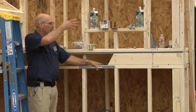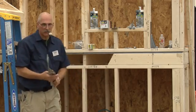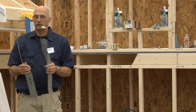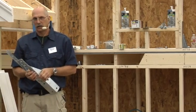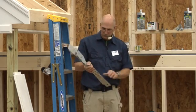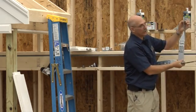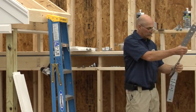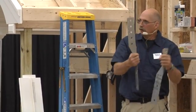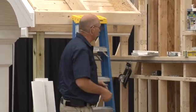We're working our way all the way up to the top. We've got a number of connections you can do. For retrofits, just like a job I had to do — this is a foundation-to-joist connection. If you're working on a crawl space or an older building and putting a second story on top, you can't get to the original structure. What you can do is use a foundation-to-joist connector — the FSA — which bolts up against your foundation and catches your joist. So alternate ways to make the same type of connection, but it's really important that it's continuous. You don't want a weak link.